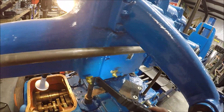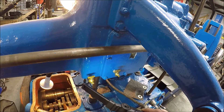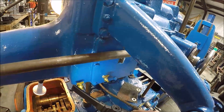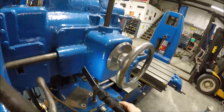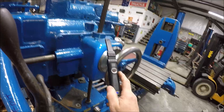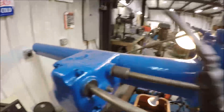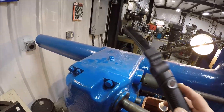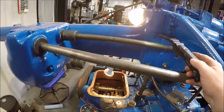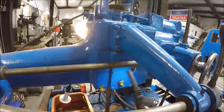Also addressing the oil leaks — I've got a little cup here and pig mats here and there. Unfortunately these really nice ornate brass valves leak. I don't know if they're rebuildable, so I'm just going to go ahead and take them out and put regular pipe plugs in, because it's already got regular plugs over here. The oil is supposed to be in here for the gears, and it looks like I've got a fill here that fills this whole area, so I'm getting ready to open these up and see where the oil level is.